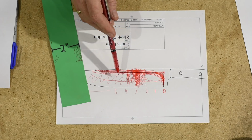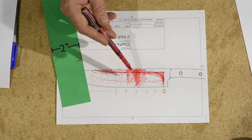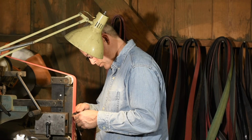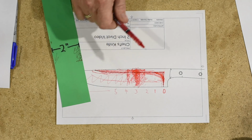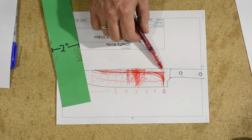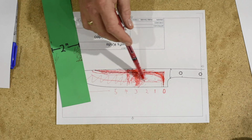Sort of a corollary to that is, don't try to fix your mistakes at 400 grit or something. First, it's too slow, and second, once you start getting up to those higher grits, 320, 400 and belts like that, there's a phenomenon called belt bump, where the little joint in the belt goes ding, ding, ding, ding each time it comes around, and it makes it harder to control the accuracy of your grind at that point. Whereas on 120, typically you're not running into belt bump issues, and so the little 2-inch divot there is a lot easier to clean up.